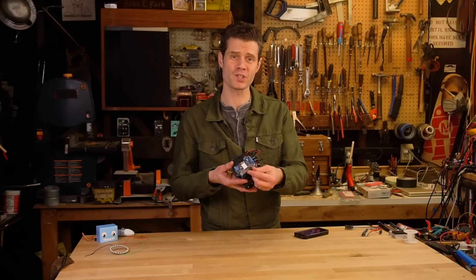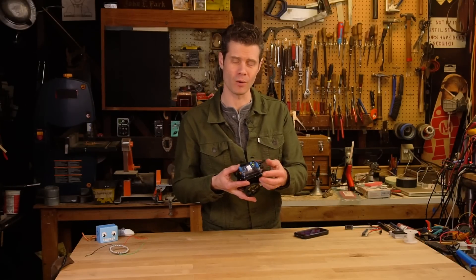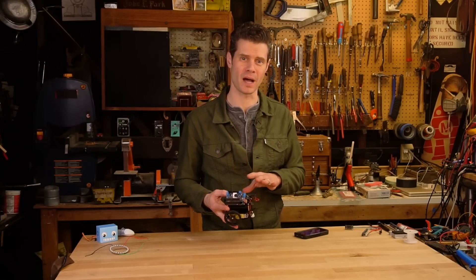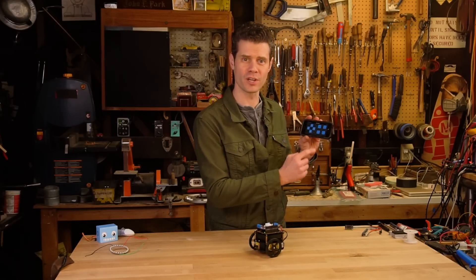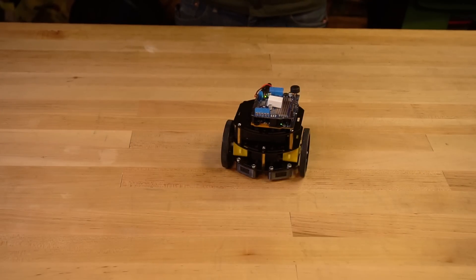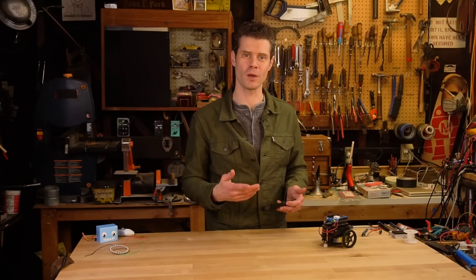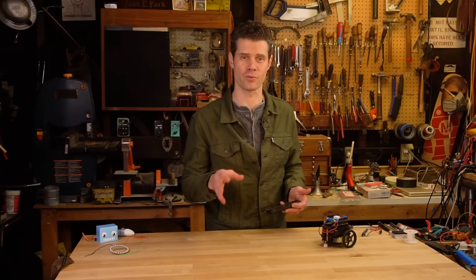I've added a piezo buzzer to pins 12 and ground on the Arduino 101. So now with a little bit of different software uploaded to the Curibot, I can play a song using one of the alternate buttons in the app. I can still drive, but when I get where I'm going I'll press this button and get a song. You can change the software to learn about using the tone command to play different songs back using different pitches and durations of the notes.